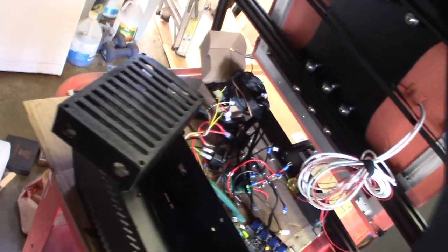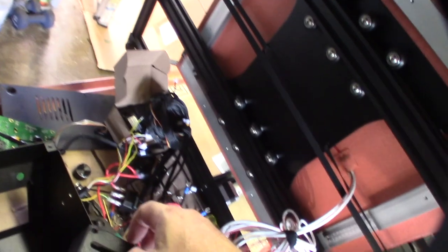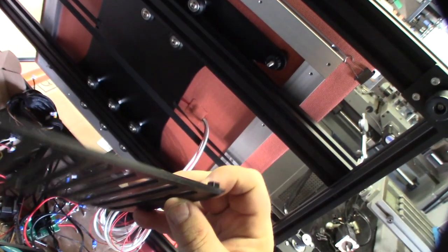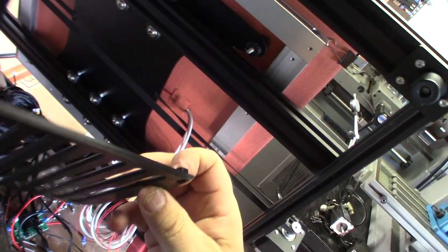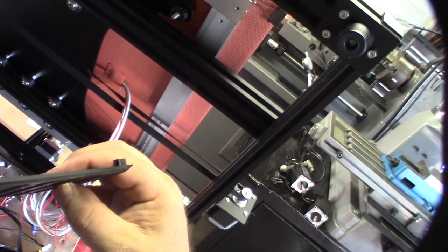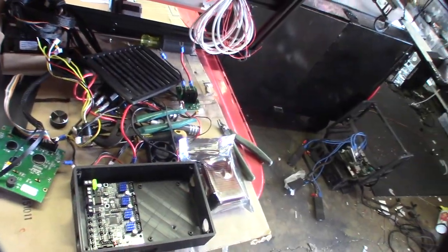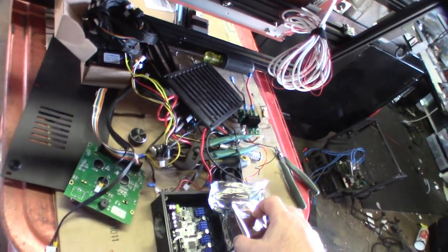All right, I've got the box gutted. When he was printing out my box, it looks like a couple of corners lifted — you can see the 45-degree angle pulling up. That's basically when you get a layer shift: the nozzle hits the curled-up edge, and since there are no encoders on these motors, the motor doesn't know it skipped a step, and that's why you get a layer shift. I remember now — he actually bought the MOSFET because that's what I originally designed it for.